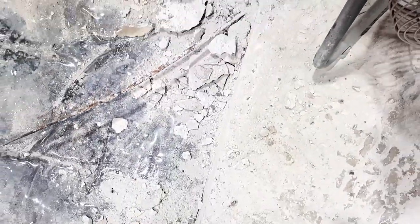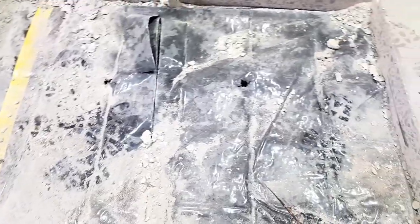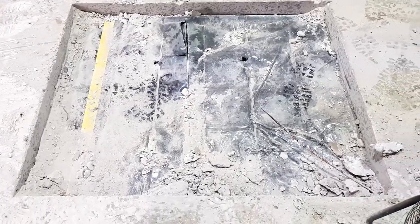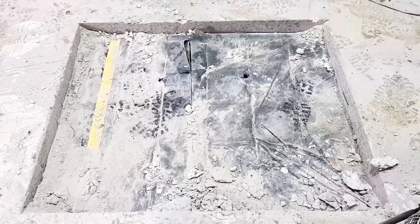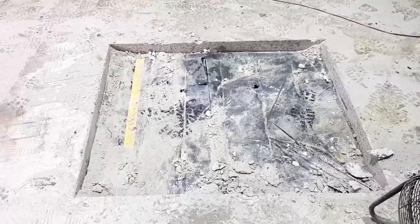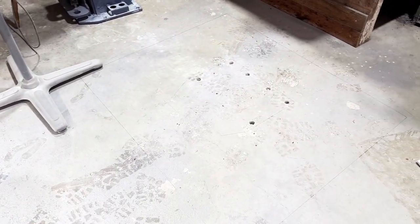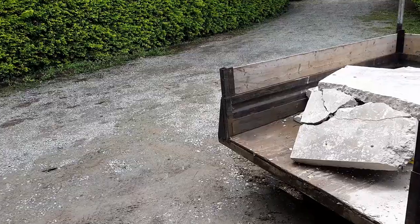There was a little bit of damage to the edge of the concrete, but that won't really matter. We'll just slurry a bit in there. Now let's use the good old digger and dig a bit of dirt out. Dig it down 150, 200, and then work out a bit of steel, and we're ready for the pour. So before I start digging, I'll cut this one. I'll do that off camera though. Let's get into some digging.